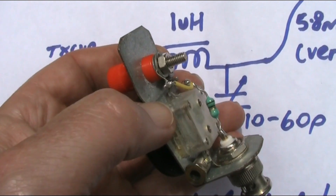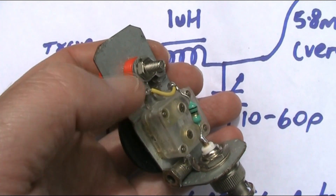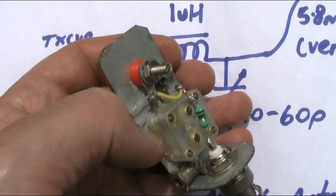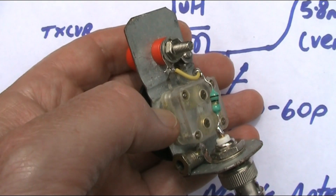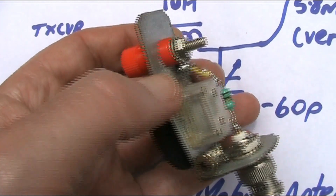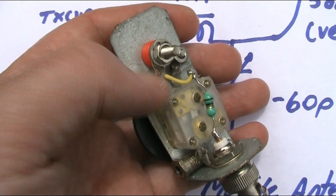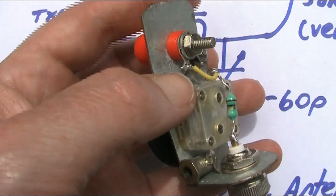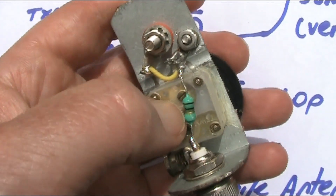If you don't have a suitable variable capacitor, I'd suggest a length of coax, because coax cable has capacitance — approximately one picofarad per centimeter. You might want to start with some RG58, maybe 30 centimeters, which will be about 30 picofarad. Then with a VSWR meter in line, apply carrier, do your tests, and snip it back until you get low VSWR. The advantage of a coaxial cable capacitor is that it has higher RF power handling capacity, which matters if you're using say a 12 watt SSB CB radio.